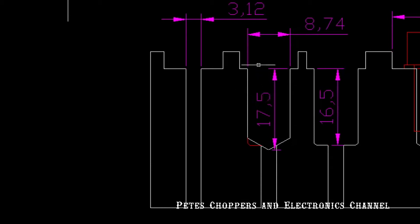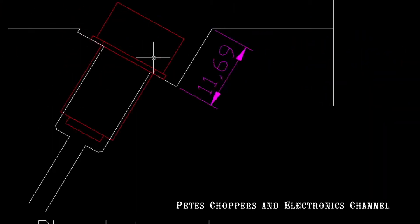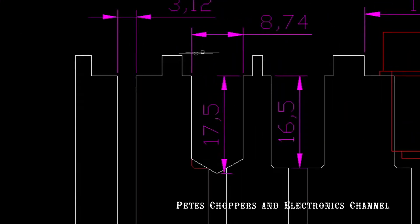What I want to explain now is what I'm actually doing with a coin. Having machined the 19mm recess, I won't know how deep that land is until I've just pierced the outside surface of the head at the shallow end of the slant. So I end up with this situation here where the large recess is machined, and now I want to bore down with a drill.